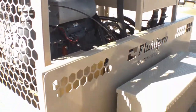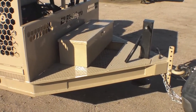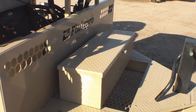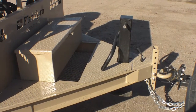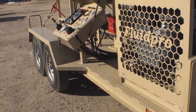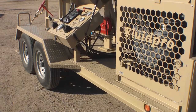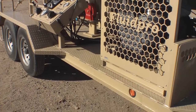While we're up here at the front of the trailer, this is a trailer that we build — it's oil field tough. We have a lockable toolbox up front, a heavy duty jack, and an adjustable pintle hitch. Looking back towards the fenders and axles, the fenders are 3/16 tread plate, pretty tough, with 6,000-pound axles. We've had the best luck with 14-ply tires, which is what this unit has on it.